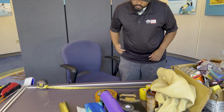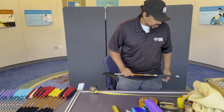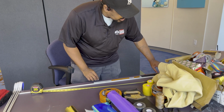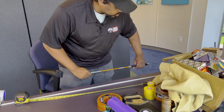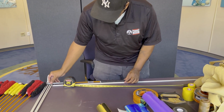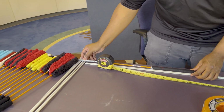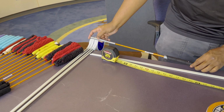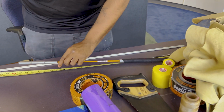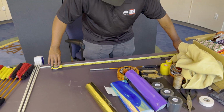All right. So marking that at 23 inches will give us about 2 drumsticks per rod. So what I like to do is make sets of sticks. I used to make single sticks all the time, but now I primarily make drumstick sets. So actually, if we measure this at 23 inches, we'll be short on the other side. So what we're going to do is shorten that. We're going to measure this completely to length and then divide in half.